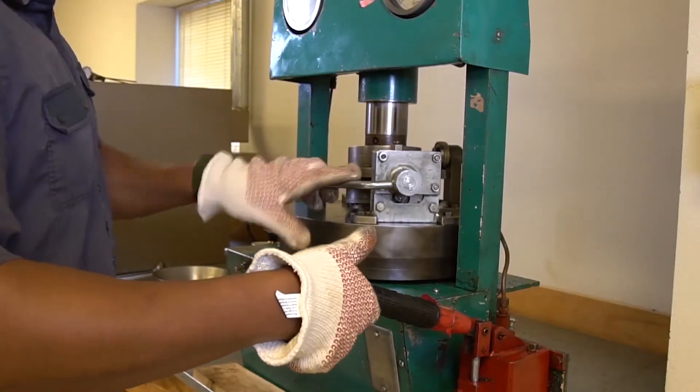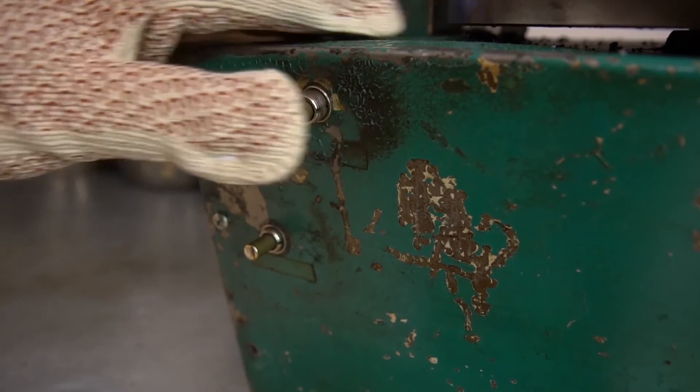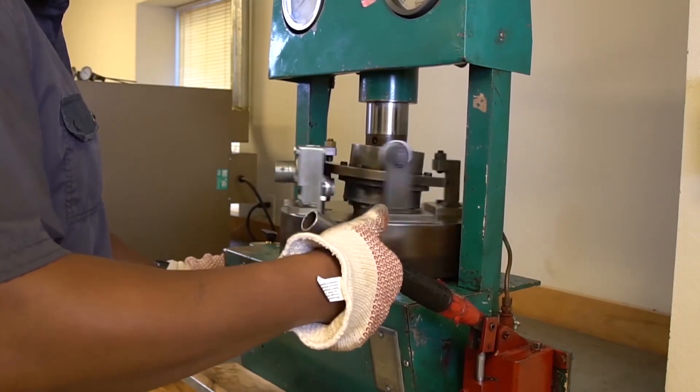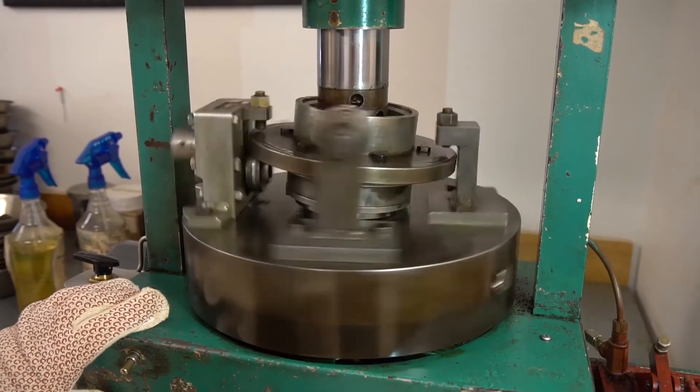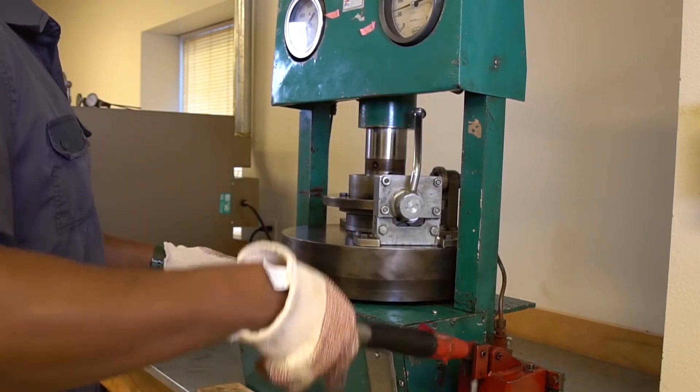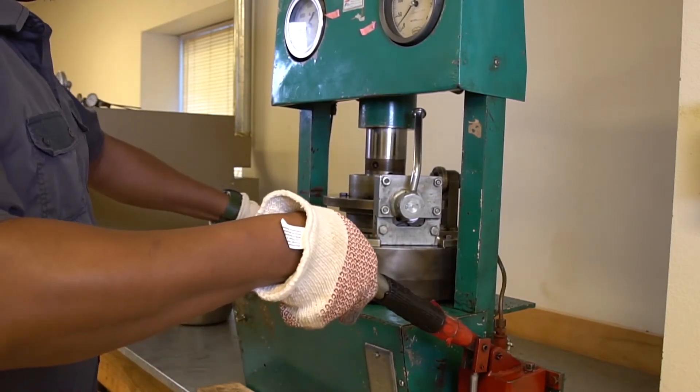Pull the handle of the cam lever down. Press the reset button, then press and hold the start button. The pump handle must be all the way up. The mold will gyrate three times and stop. Level the mold by raising the cam lever with the left hand while making one full stroke of the pump.